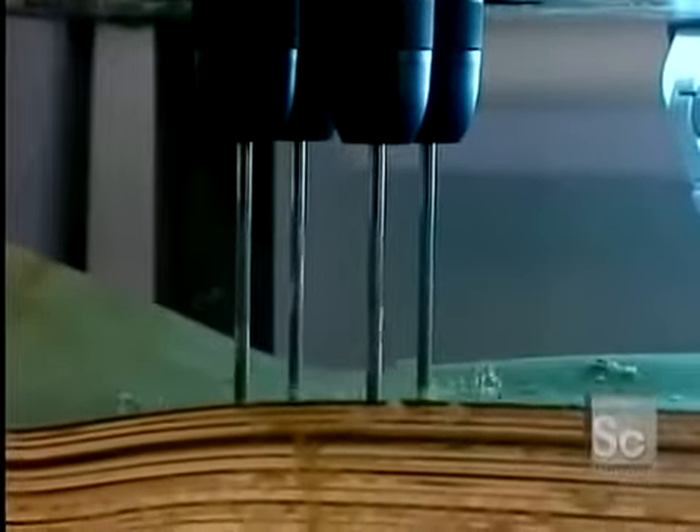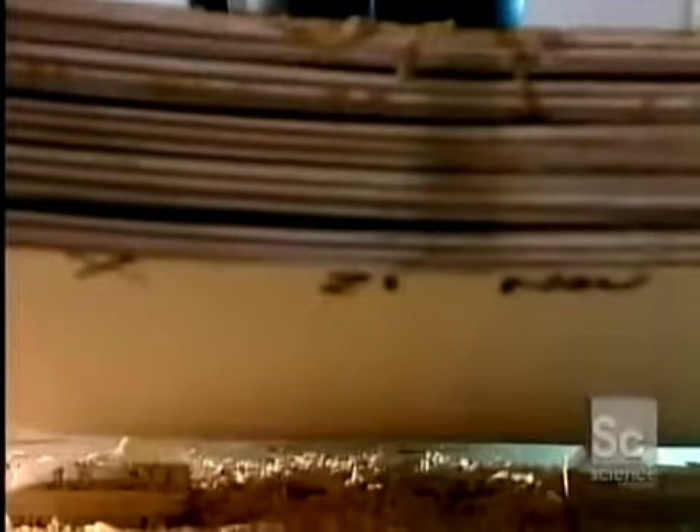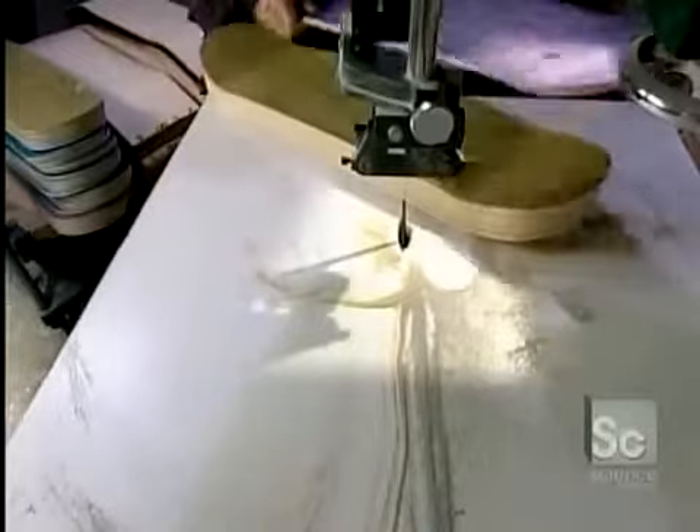The block comes out after three hours. Now they drill two sets of holes through the block — these are for mounting the front and back trucks, the pivoting metal axles that enable the skateboard to turn. They select a template in the general shape of the model they're making, with pins underneath that fit snugly in the truck holes. This holds the template still while they do the rough cut, sawing around the template leaving a one-inch margin.